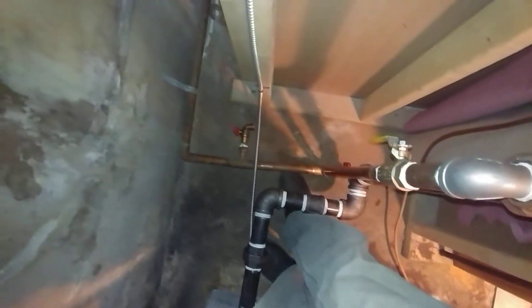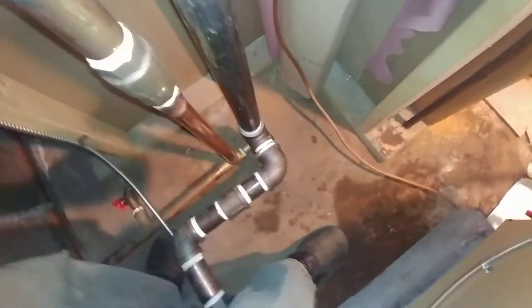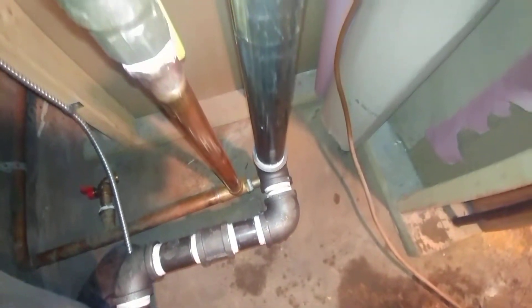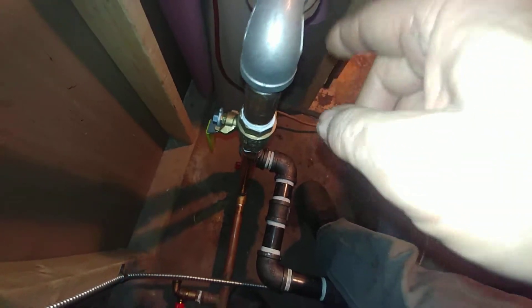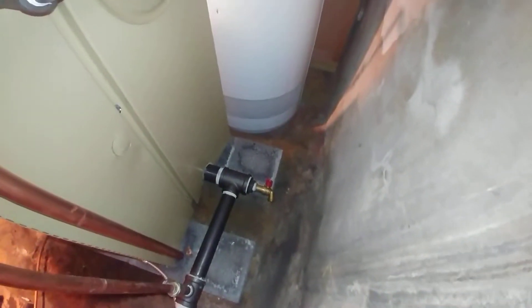So we've got the original wet return. It was replaced at some point, probably when this basement was finished off. They added a drain — it's sort of an afterthought. And I added another drain on that T there, because you can never have enough drains on a system. I've got the transition to a shut-off valve and a brass T, stainless steel street elbow, and a cast iron T. This was copper, and I just removed the copper and put this in in threaded steel. And replaced this. Another drain in the back, as always.